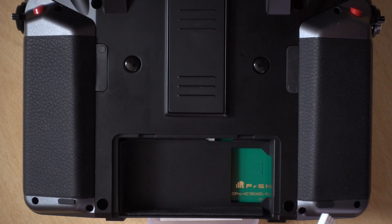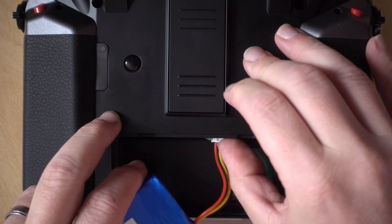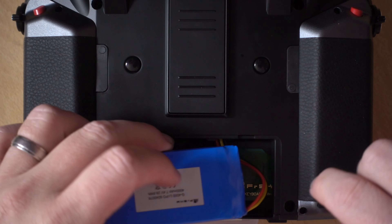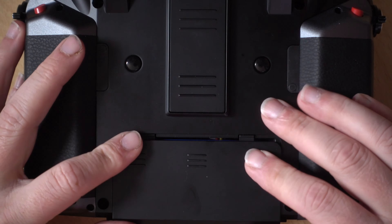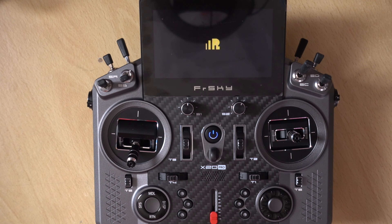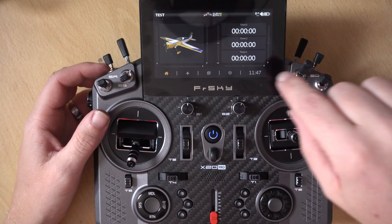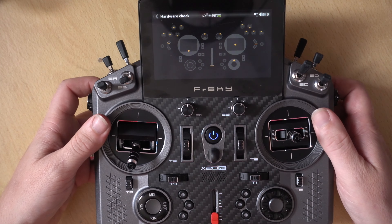The last thing we need to do is put the battery back in. This uses a standard balance connector and inside here the pins are actually at the top, so on our connector we need these two little rails towards the top. That just pushes in, and then it's just the case of inserting the battery. There's a cutaway here so that cable should disappear in there quite nicely, then put the back on. The last thing we do is just power on to make sure everything is working well. We need to make sure our switches are still working okay — we can do a hardware check over the two latching switches and they're all good.